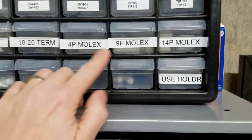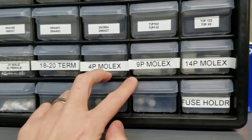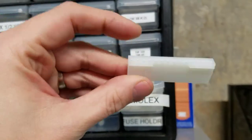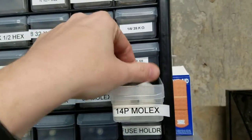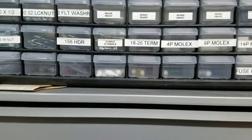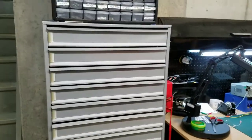When I first bought these doing some pinball restoration, I didn't realize you can just buy a 14-pin or larger connector and cut it down to make it fit the right size. So note that a 14 is really big — just buy larger and cut down.